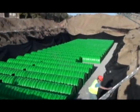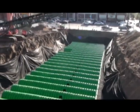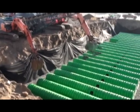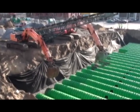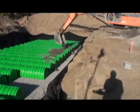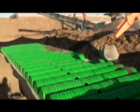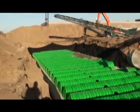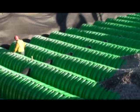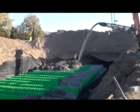With the Triton chambers in place, the drain field is ready for the placement of stone. Because the St. Cloud installation called for a double stack of Triton chambers, the first layer of crushed angular stone will be built up to one foot above the chamber height. During this process, the chambers are anchored by ladling stone directly over the chamber's centre lines. Frequent checks are needed to ensure that proper distance between chamber rows is maintained, and that the amount of stone around the chamber does not exceed 12 inches from one side to the other. Stone may be placed through a variety of means, but the use of a telescoping conveyor boom truck is the most efficient and cost-effective way.